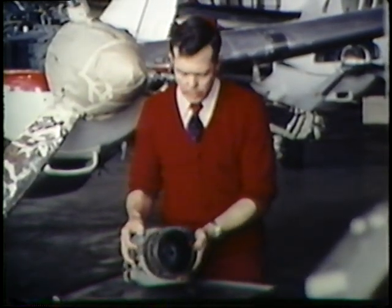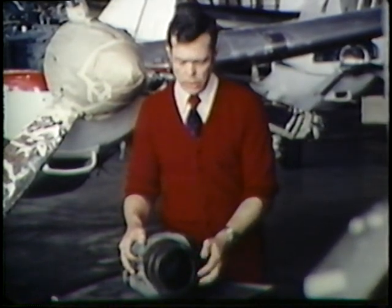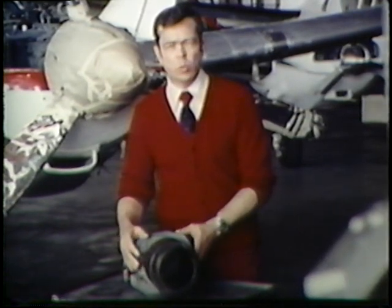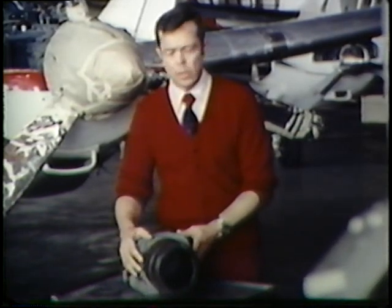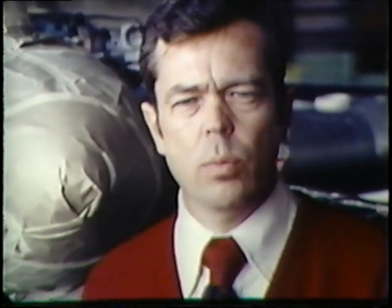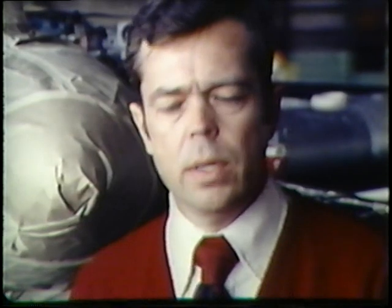This is a typical example of an aircraft engine that's been left in storage for a period of time. The cylinder walls have rusted, causing pits and damage internally. The oil drains away from the cylinder walls, allowing moisture to enter with the air and corrode the cylinders. One method of preventive maintenance is to remove the upper spark plugs and rotate the engine through while spraying oil internally into the cylinder, trying to coat the walls. This is probably the best measure for preventive maintenance if an aircraft is going to be stored for any period of time.